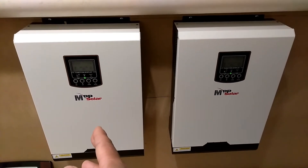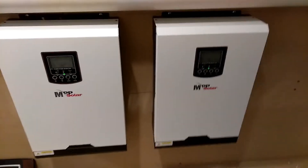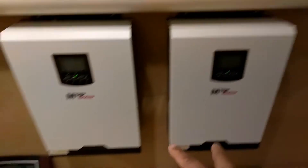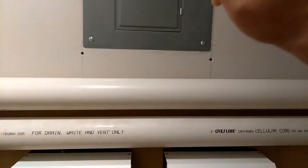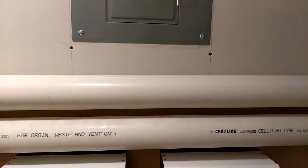That's not what I was trying to do. This unit has the load it's going to supply, and this unit has the load it's going to supply. When you hook these units up to your sub panel, that sub panel cannot be bonded independently - you have to bond this sub panel to the two units, so when it's running off these units it's bonded through them.